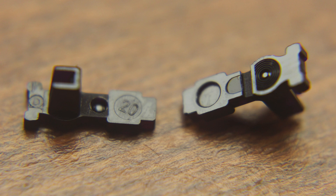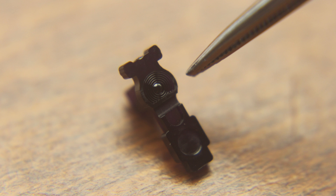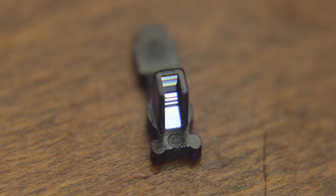To achieve all this, the switches contain this piece of plastic, which is actually a polished filter containing two lenses and a reflector. The plastic is colored a dark purple to filter out unwanted frequencies. The first lens is this one on the bottom, which focuses light coming into the switch from the LED on the circuit board. Then the upwards beam encounters this reflector, which looks a bit like a set of stairs, which reflect the light sideways.